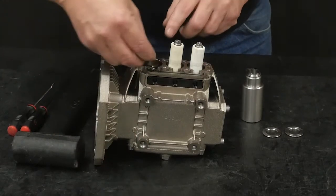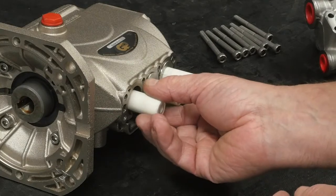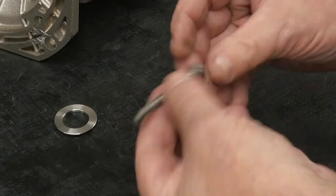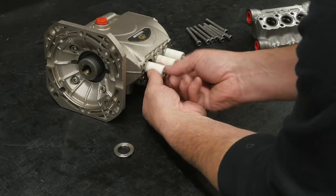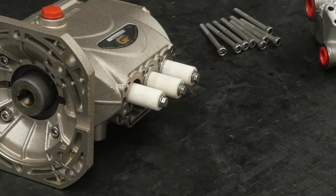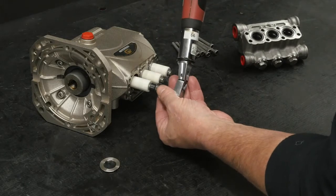Install the flinger back onto the guide. Install the plunger onto the piston guide and place the new seal washer onto the plunger bolt. Install the flinger onto the piston guide. Thread the plunger bolt into the plunger. Use a torque wrench with an 8mm socket and tighten to the specifications.